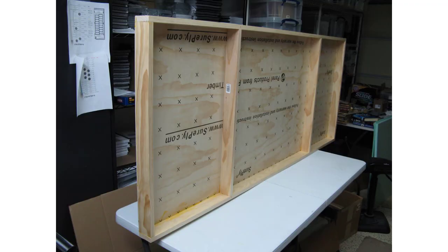This is the basic platform or table — inexpensive just-under-quarter-inch plywood with one-by-threes to stiffen it up, glued and screwed. You can remove the screws once the glue sets because it's not coming apart if you glue it well. But you may want to remove them because later, if you go to run a nail or something down into the platform, you might run into the head of a screw. Not a bad idea to remove the screws at that point.